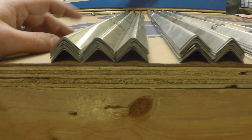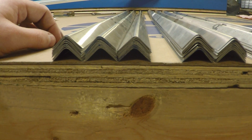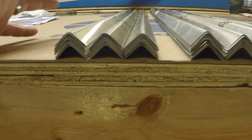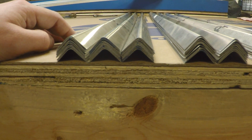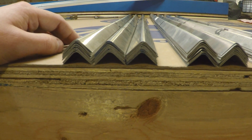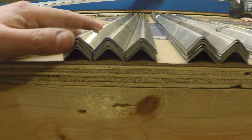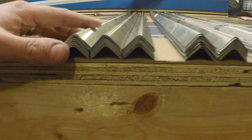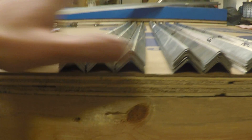The easiest way to do it is simply to cut a 36 millimeter piece off the end of a four-foot-wide sheet of aluminum, file the burrs off of each side, leave the factory edges alone, file the burrs off the long edge, then mark a line down the middle and put it in the brake and bend it. What I typically did was cut 10 or 12 pieces at a time, file each one after cutting, and then bend them all in the brake. Just a very tedious process.